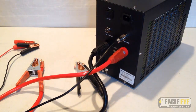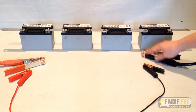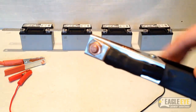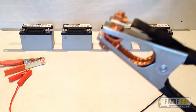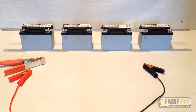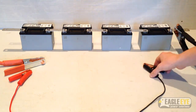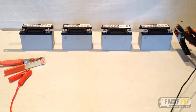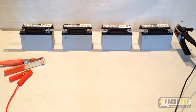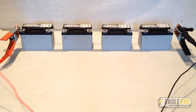Now that all the cables are connected to the load bank, we can move to the battery string. For this video, the load bank will be connected to a small 48 volt battery string. For connection of the discharge cables, there are two options. By default, discharge cables will have clamps connected. However, if the clamps are removed by unscrewing this bolt, the cables can be connected directly to the bolts of the battery posts through this loop. Here, we will be connected using the clamps, starting with the negative cable on the most negative post of the battery string, then the negative total string voltage clamp. On the most positive end of the battery string, connect the positive discharge cable, followed by the positive voltage test lead cable.